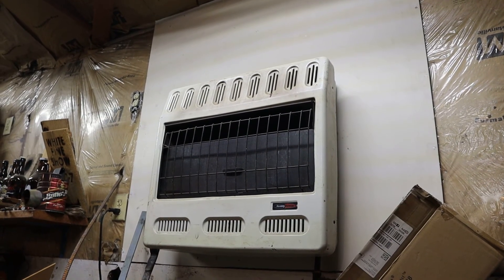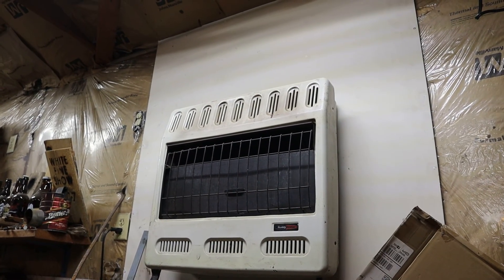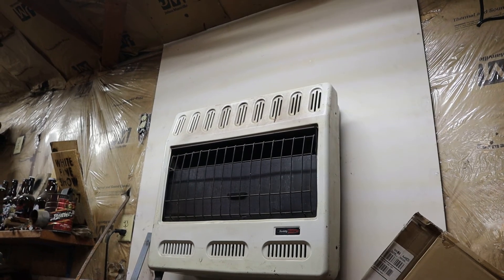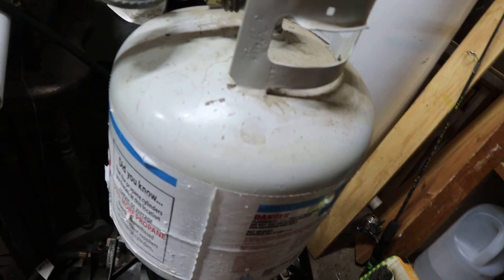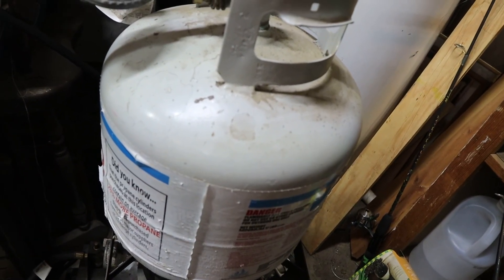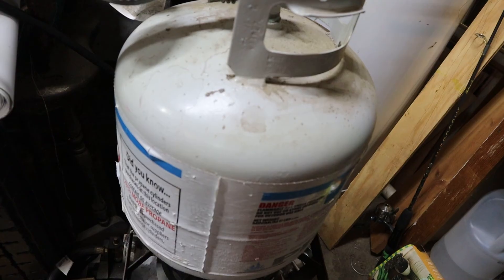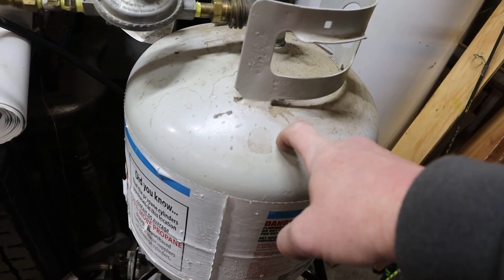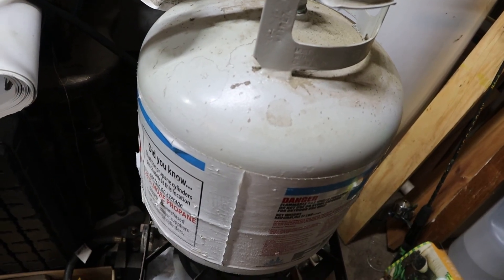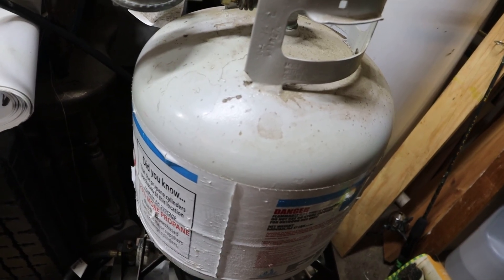Right now my garage is about shy of 40 degrees, and it's been running quite a long time. In Minnesota, 40 degrees is pretty warm. When it comes to the forge and blacksmithing, what I'll do is just swap these tanks out when they get cold - put a fresh one in and run that one until it starts to frost up, and just swap the tank to keep the PSI up. Like, subscribe, hit the notification button, and we'll catch you next time.